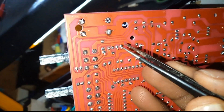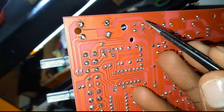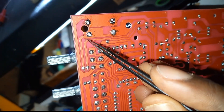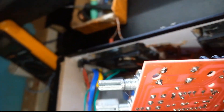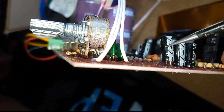Here at the equalizer, you can see there's one for left and one for right channel for the mids. You hook the signal coming to this capacitor — that is the left channel — and the right channel goes to this other capacitor. Mids are filtered by capacitors, whereas bass is filtered by those 22k ohm resistors.